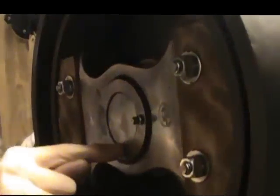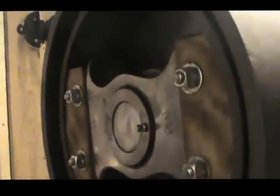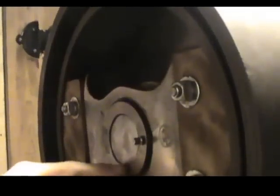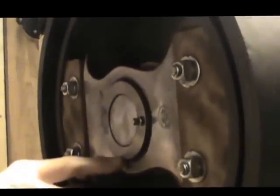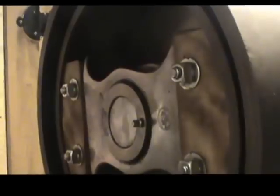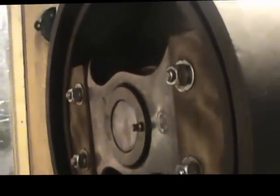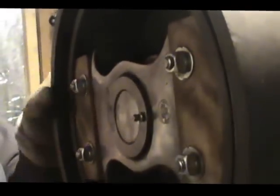We're going to do a Dutchman's drill right on the very edges of those, perpendicular to each other, there and there. And what we'll do is we'll drill in that groove, which will be halfway in the spider and halfway in the main shaft, and we'll tap those, and then we'll put a bolt right in there, and that'll attach that spider to the main shaft. And we're going to hook up the clutch collar next and show you what that's going to look like.